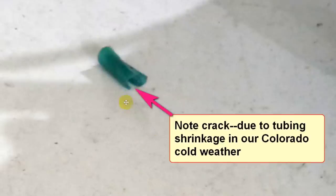Do you see the split? The cold weather causes that stuff to split. We've had some days where it's been 20 degrees Fahrenheit or in the teens — well below zero Celsius. That is what caused the problem with that ancient green tubing, which was put in around 2007 and probably would have been fine then, but it spent so much time in very hot, unventilated hangars for about 10 years while the aircraft sat idle.